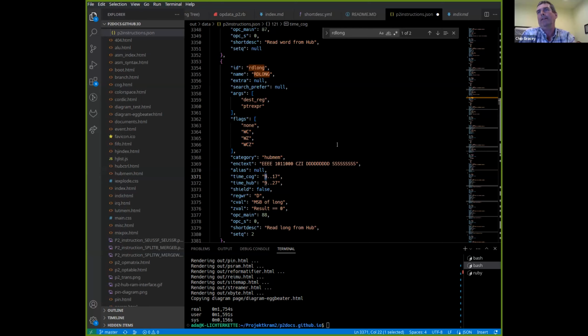I had to add a lot of flip-flop layers, because when you're dealing with the memory, you've got long wire lengths that go all over the place because it's shared among everybody. And lots of those memories are around the perimeter of the chip. So there needed to be a lot of registers at certain junctures, just so that we could get the signal across the wire by the next clock cycle into the flop, and then from that flop it would go through some logic into another flop, and then eventually it gets into the cog. But it was a long process. Otherwise it was a timing problem on the silicon.